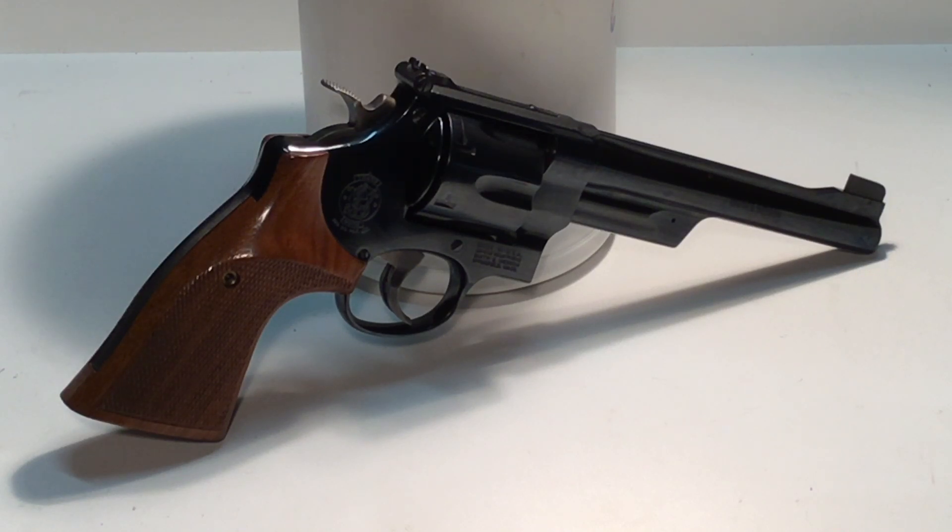The geometry of a six-groove barrel is easy to measure when you slug it. But the problem is when you try to use the same technique for a Smith and Wesson revolver barrel or auto pistol barrel — anything with five grooves or an odd number of grooves. It's very difficult to just slug the barrel and measure the bullet, because you're going to measure from a groove to a land, and your measurement will be off — it's not the true groove diameter.